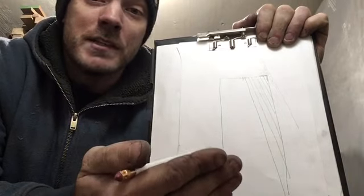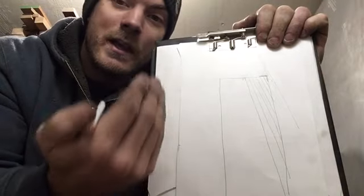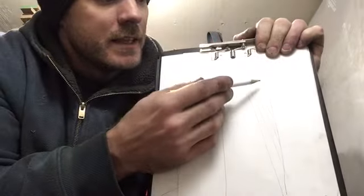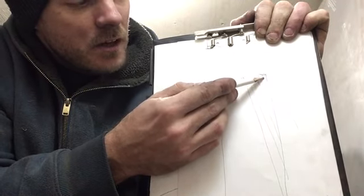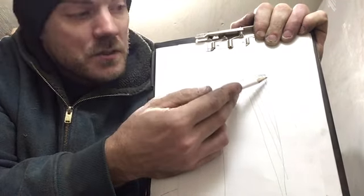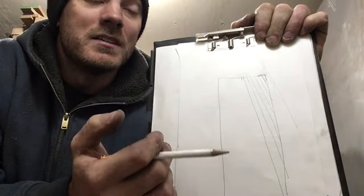So if you're using a nice brand new belt, it's just a chisel chipping away all those little grits, and just dulling your belt. And then once you get done that first grind, and then the second one, that angle is almost 90 degrees too. So that's just as aggressive. So you're chipping away more, and you're just killing the life of your belt, especially if it's a brand new belt.